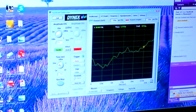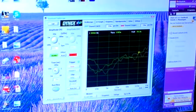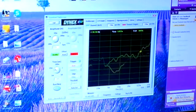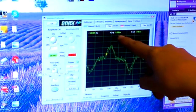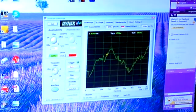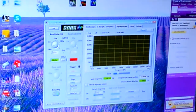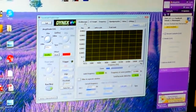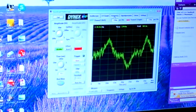One of my hex motors right there - and this is what the best I could get was: a wave that looks like this, which is still workable because I'm getting a peak-to-peak of 1.6 for vibration. Now that cleaned up a lot when I use this filter. Watch what happens when I turn the pass up to 9300 - see that?